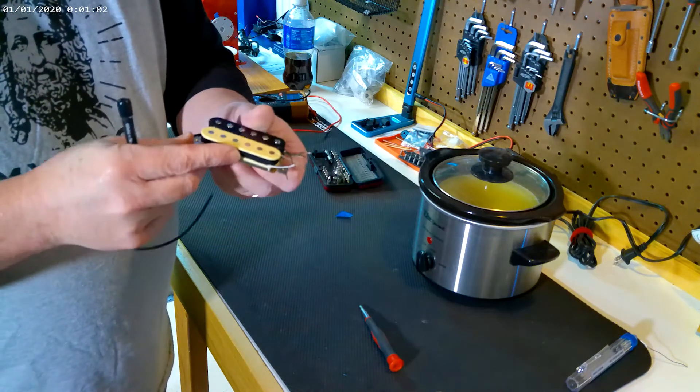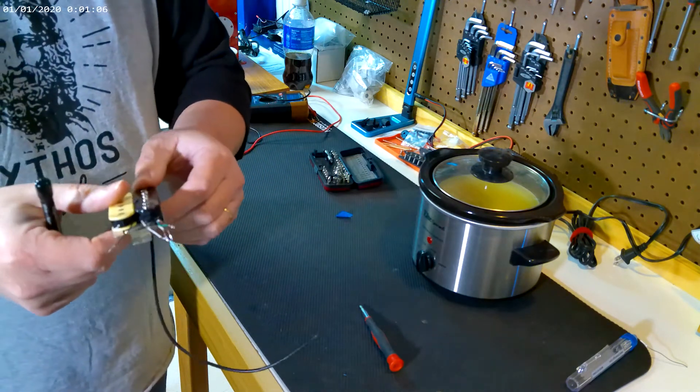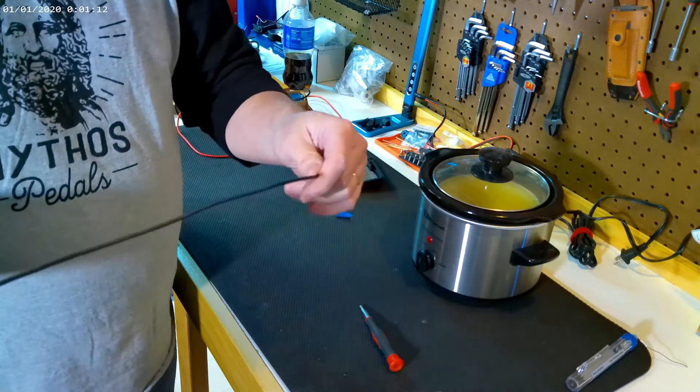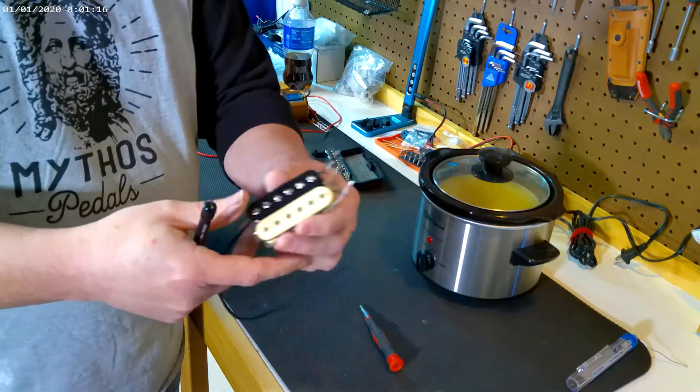So what I've done is I've got the magnet installed and tightened it down. I've left a little room in the front here, and now I'm going to solder up these wires on the pickup to the four-wire connector. I've got to solder all the slugs together to my four-wire connector and this pickup will be complete.